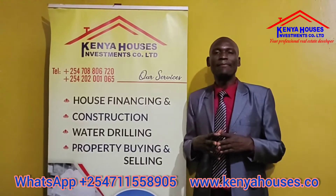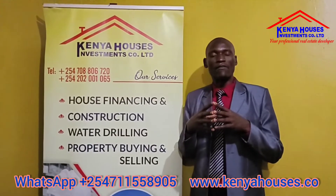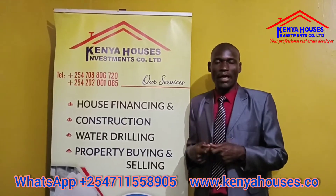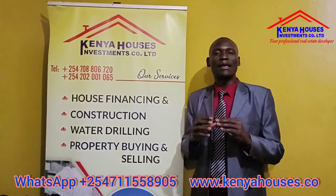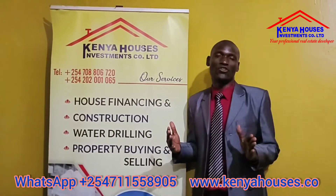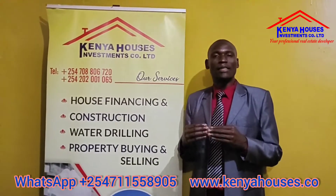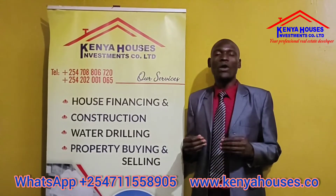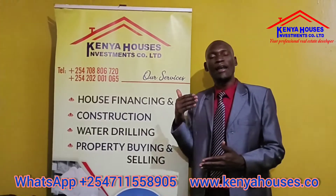These reports are needed by the government authorities. Once the hydrogeological report and the environmental report are out, they are presented to the government authorities for permits to be issued. Remember, you cannot drill a borehole without the government authorities. There are relevant government authorities in every country that regulate boreholes or regulate water. Once the government permit has been issued, the driller will organise and mobilise the machine and start drilling according to the hydrogeological survey report.